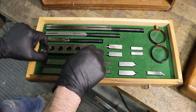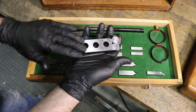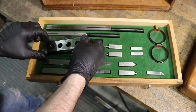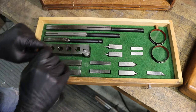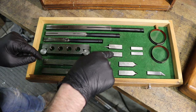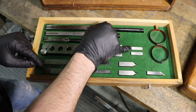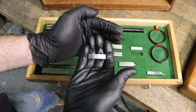We've got a five-inch master sine bar that looks to be in immaculate condition. I don't know that it's ever even been used — there aren't even scuffs on the rolls. Beautiful five-inch sine bar. Then we have parts that you would use in conjunction with a height gauge, which I'll show you in just a second. Finely lapped. This is a three-quarter-of-an-inch piece, quarter inch, quarter inch — several of the same ones used for different purposes, I guess. This nominal 0.7 inch piece, and then a gauge here. I don't know if you use these two together — you guys fill me in.